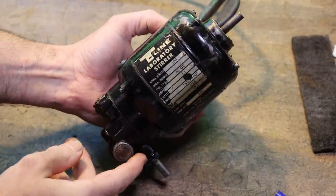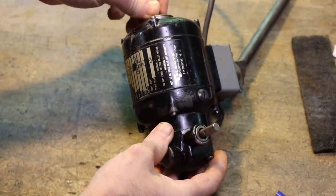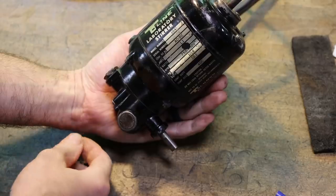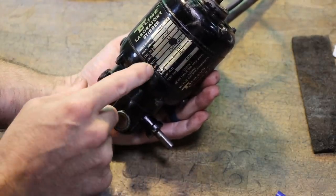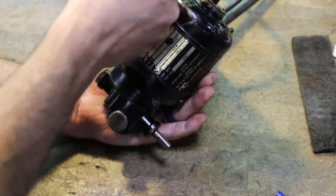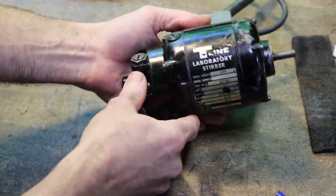So this old stir motor is really neat. Definitely an industrial piece. It is Talboys Engineering Company, Emerson, New Jersey. And it's AC-DC, so it's brushed. So it'll run on AC or DC voltage, right? It is 1.1 amps. Like I said, 750 RPM on the reduced side and 7,500 on the main output. It is 1/18th of a horsepower, and like I said, 10-to-1 gear reduction.